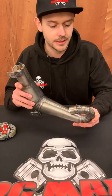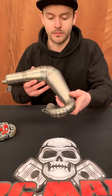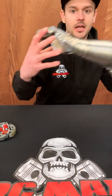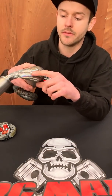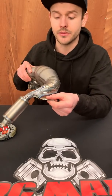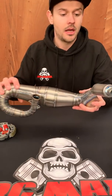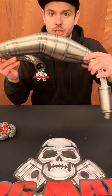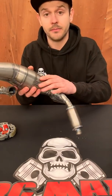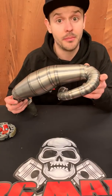All engines — whether GT or supreme — are going to come with titanium pipes as standard. We've been so pleased with working with titanium; the weight saving is roughly half a kilo per pipe, which is significant on an RC car. This is our Vector pipe, and this is our Losi pipe, which has actually been updated very recently — we've got much more bracing where some steel part pipes broke. We've never actually broken a titanium one, but we've braced it anyway. We've also adjusted it to suit the 110 millimeter case and the new gear ratios. We've changed the shape at the front to give much more clearance to the head, and it fits in the car a lot better.